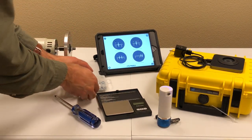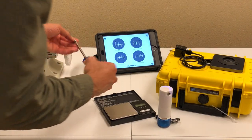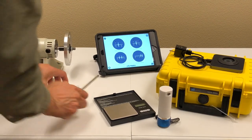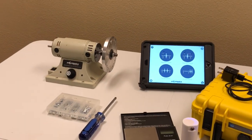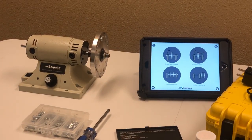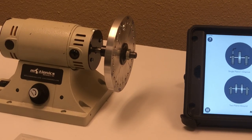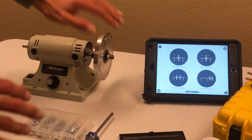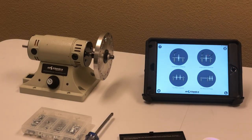Let's start the balance. This rotor is a little bit imbalanced but pretty close to balanced, so to introduce a known imbalance I'm going to use one of these screws. I already know this screw weighs 1.7 grams. I'll place it randomly — let's say at 120 degrees. This is a custom motor we created for balancing tests and demos. The rotor has holes at certain angles where you can attach screws as imbalance weights. I've just added that imbalance weight of around 1.7 grams.